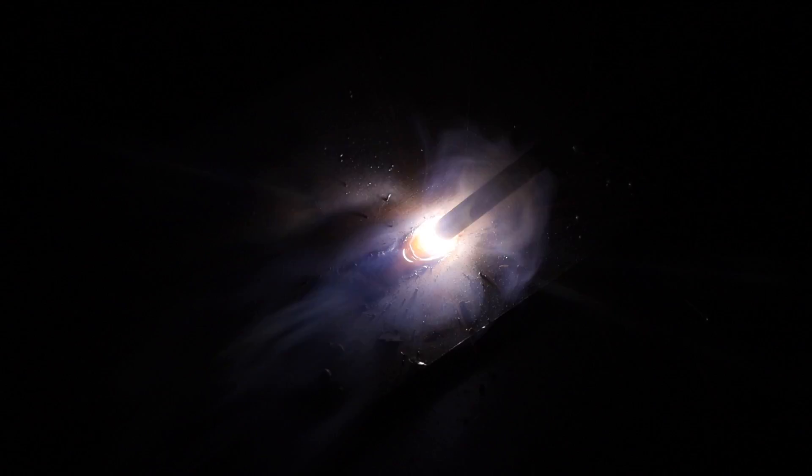These are some of the fundamental concepts behind weld distortion and you can use a little bit of common sense in how to deal with it. The first technique is to reduce the overall amount of weld you're putting on there. If you're running a fillet weld, you don't want to oversize it beyond what you need. Watch as I run this one-eighth inch electrode pretty slow, then move on to a three thirty-seconds of an inch electrode run a bit quicker. You can see there's a significant difference in the size of the fillet welds, and that's going to reduce the amount of distortion.